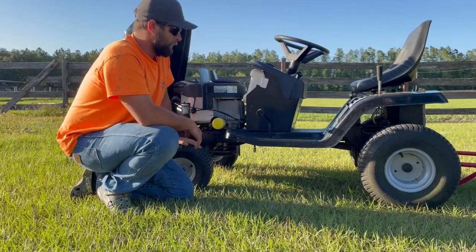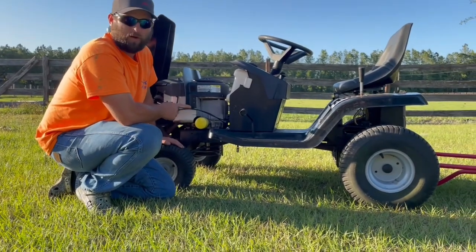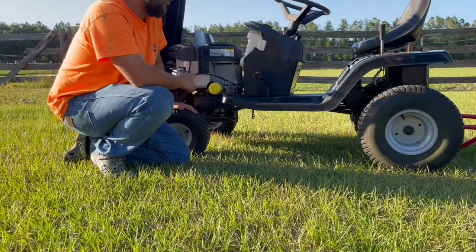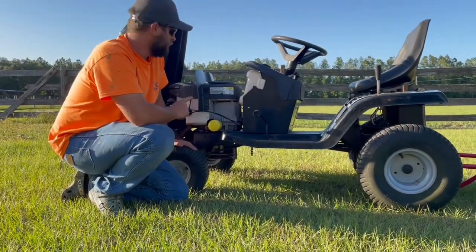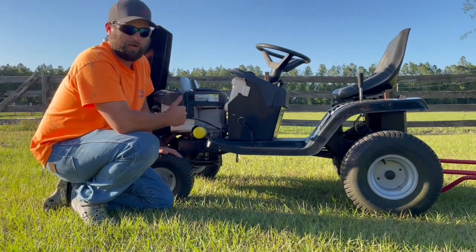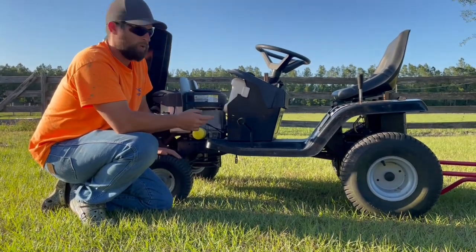I think we're going to look in here. I actually found a wire in here that you can disconnect — not recommending this, y'all do this at your own risk — but there's a little wire on the Murray that you can unplug that bypasses the seat safety, which in turn lets you get off of this thing without locking in the brake. I'll bring y'all in and show y'all that.